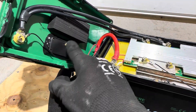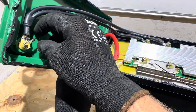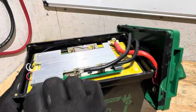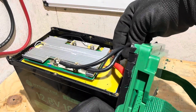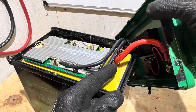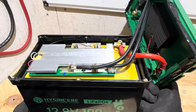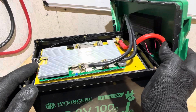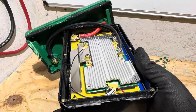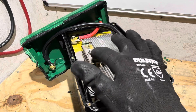Starting up here on the lid, there's a little display on top — basically just a voltage meter. You can see the positive lead goes over here to the positive cable, and the negative lead comes over to the negative cable — just a voltage reference point. Getting a better look at the wiring: we have two number eights on the negative lead, and then on the positive lead that looks to be a six gauge — six gauge, 200 degree jacketed on the positive lead. All the connections on this battery are super tight, nothing loose, nothing moving around. And over here on the side of the BMS, there's a common negative bus bar coming up from the cells instead of wires like you normally see.